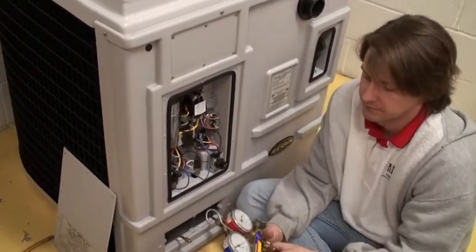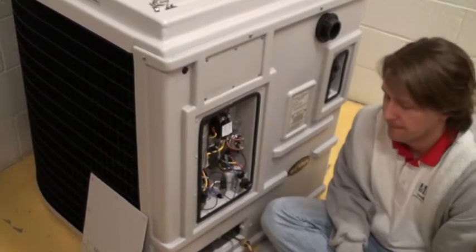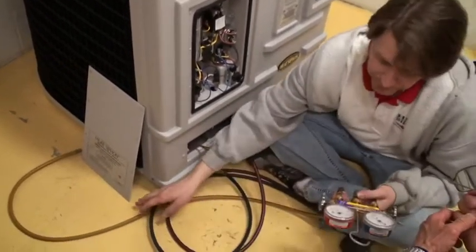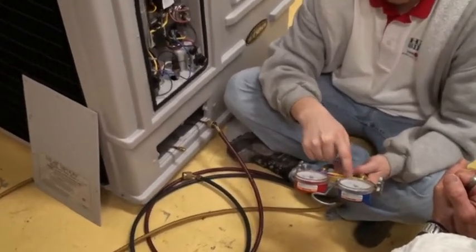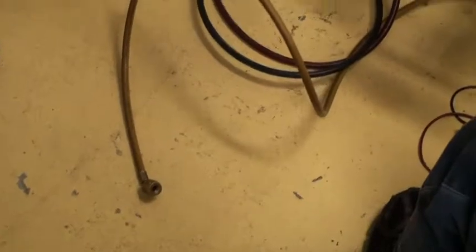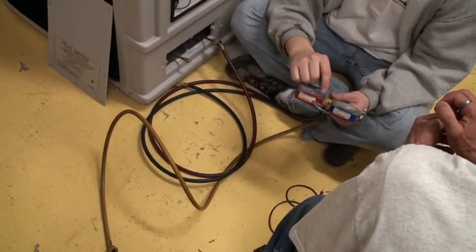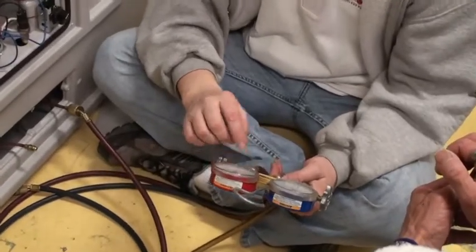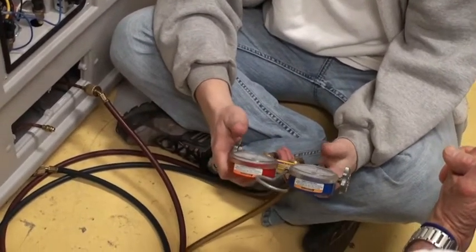What if it won't run at all? What might happen when it's low on refrigerant: it'll kick off at 40 and then equalize at like 75, which isn't high enough for this to ever kick back on. But when you put the gauges on, it'll be way down low. These two valves on the side just allow pressure to go to the pressure gauges or not — you're going to want these in the off position. They allow access to this port, and if you were to charge this with refrigerant, you'd hook this up to a tank. By opening that tank — it's usually higher pressure than the system — you'll open it up and if you see the needle start going up, that's because it's seeing the higher pressure of the tank going through. If you open it up and the pressure goes down, that's the pressure coming from the unit into the tank. We're starting to get into the R22 stuff that you would learn if you wanted to do it yourself.